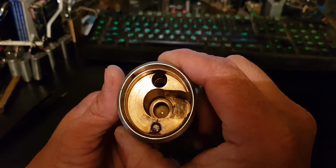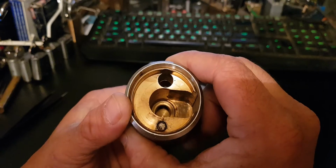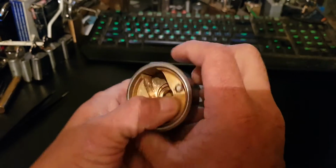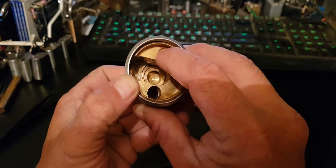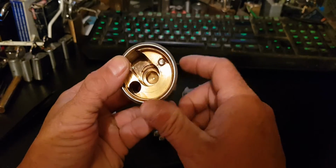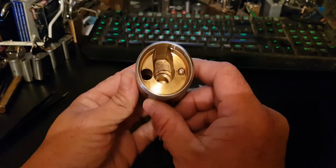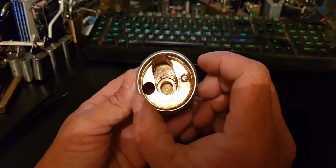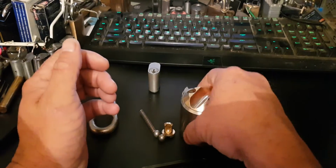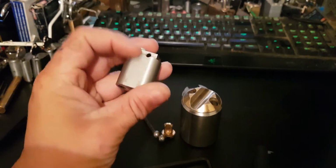It's not going to show up very well in the camera, but in 2 positions, not that line just there, but further up, there's a line where you can actually see a steel circlip, and once you remove the nylon washer from in there, you can get this bolt out as well, and there's another one up the other side. The circlip would have to come into the center before you'd be able to remove the sleeve. I haven't figured out a way of doing that yet. But that's all it is. That's all the core is.